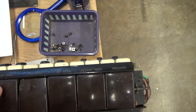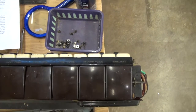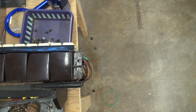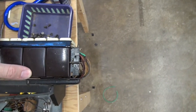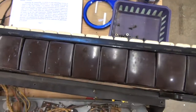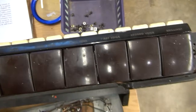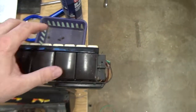With full tone on, which is basically just flat, second voice puts a resonance near 800 cycles. These are basically just peaking filters that they've included, and they use chokes and capacitors rather than resistors and capacitors, and I think that gives them a slightly different sound. Then brilliant — the signal develops across an inductance, emphasizing the higher frequencies. It also makes it about twice as loud.